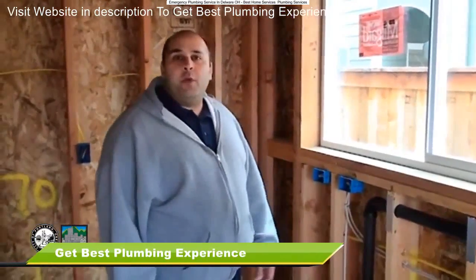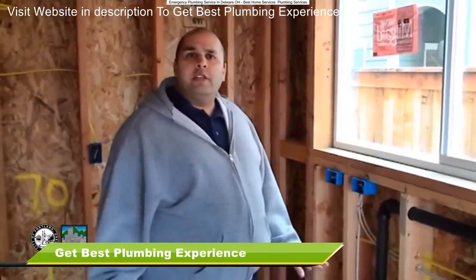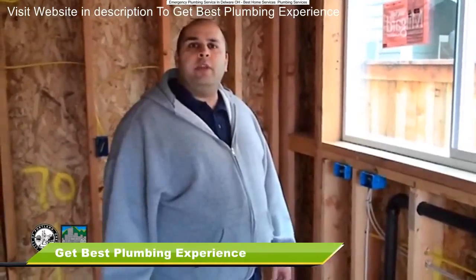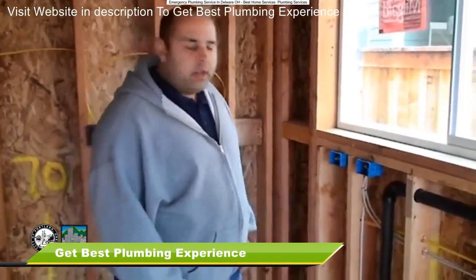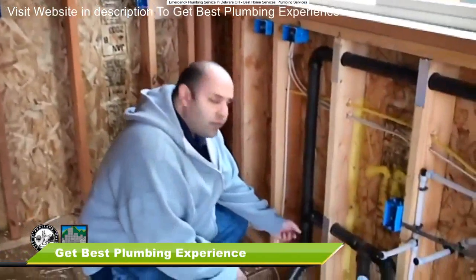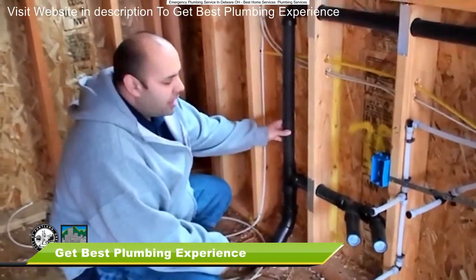I'm Marcus, City of Portland. I'm a plumbing inspector. We're going to be going over this kitchen layout right here. This is a single-family dwelling, and we're going to be doing the waste, vents, and water supply systems. We're going to start here in the kitchen. As we come down here, the drain size for this kitchen sink is 2 inch. Our vent is 1.5 inches.